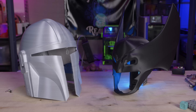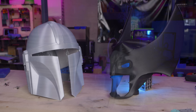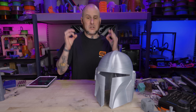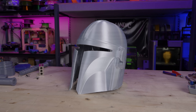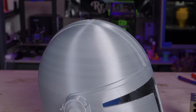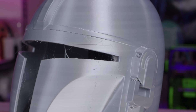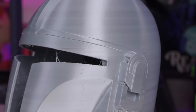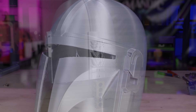Moving to the Mandalorian helmet, I started using a 0.8mm nozzle and things changed big time. I've grown pretty impatient — I like to run large nozzles on bigger printers to get prints done quickly. This used a 0.4mm layer height and the layer consistency looks pretty good. You can see some serious stepping on the details, but folks printing cosplay stuff are likely to post-process their prints anyway. This one printed in 27 hours — a full day saved versus the Wolverine helmet — and used 1.4kg of filament despite being larger.